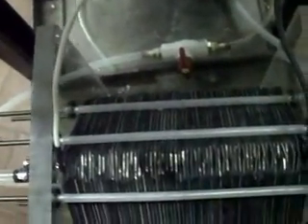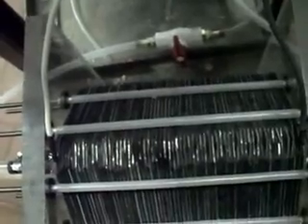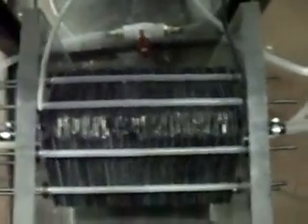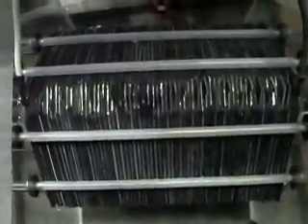The 110 or 120-volt house voltage is being divided by all the neutral plates in the middle, so we're getting the same type of voltage between each plate gap as we would have got on the regular diamond cell — and actually it might be even a little bit less; I haven't measured it yet.